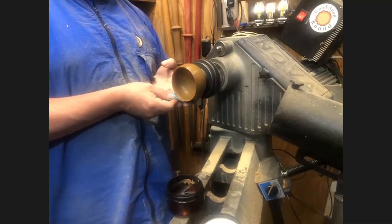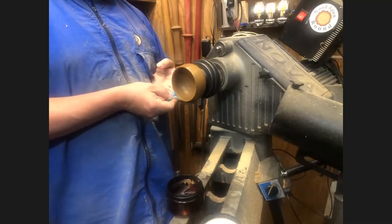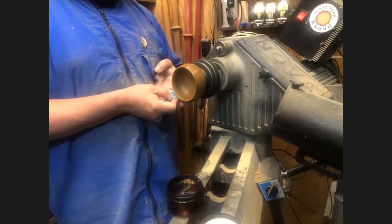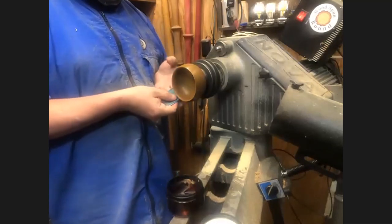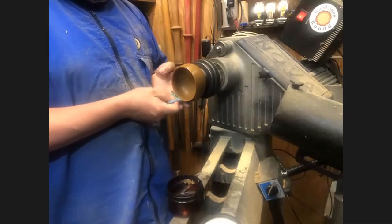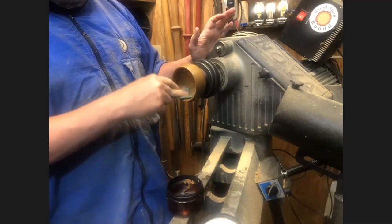Dane, one of the things I've discovered with this, I heard people say it, but then I've experimented with it as well. The speed as you turn it up doesn't matter. Just that you're increasing the speed, and then you change the part of your paper towel that you're using. It does two things. One, the speeding up and the more friction causes that abrasive to break down further. Your clean paper towel section helps. It's starting to remove the excess abrasive and also removes the beeswax and the mineral oil that's in here.